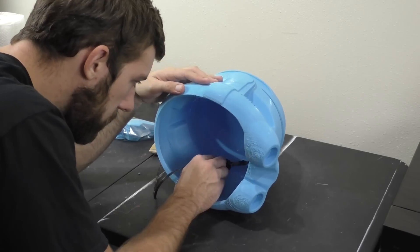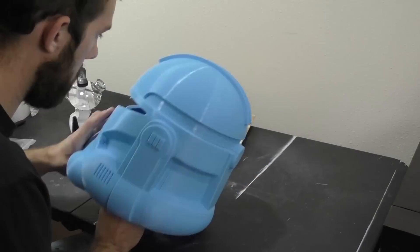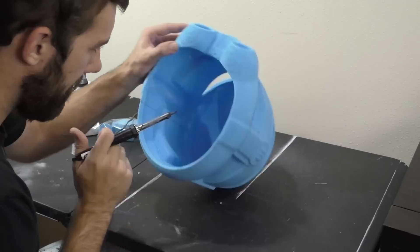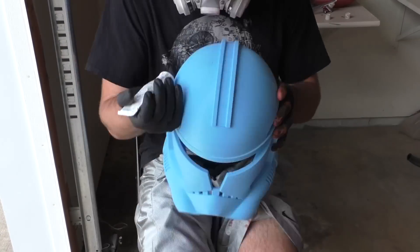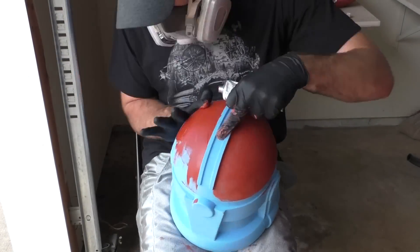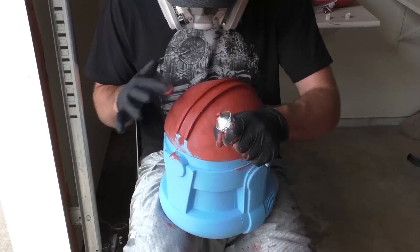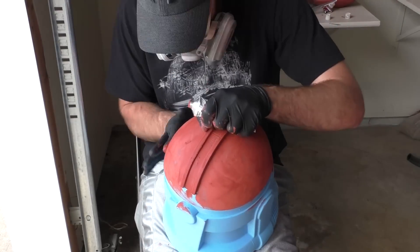I'm going to leave the antenna off for now so that we can complete that later on. Now that we have the main body all assembled, we can move on to smoothing out the 3D print lines. The day may come where we don't have to sand down the 3D printer lines — that's mostly the case in SLA printing where layer lines are at the nanometer level. But as far as FDM printing goes, we're going to have to smooth out the lines so that our surface is nice and smooth and you can't even tell it was 3D printed.